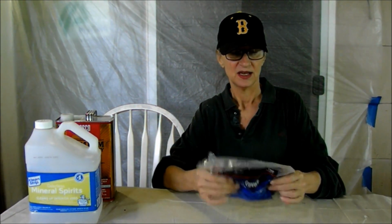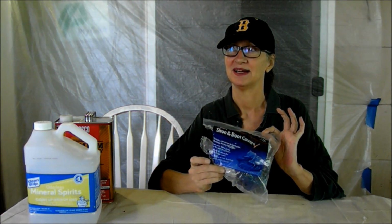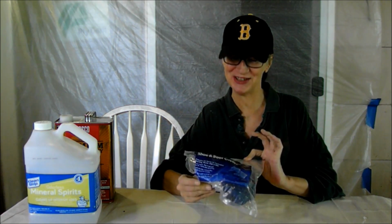Okay. The other thing I was using was these booties, and I learned the hard way that this is an important thing to do, because I accidentally stepped in some stripper with my sneaker and then tracked it, without realizing it, and then I was going barefoot and I burned my foot. So that's not good. Also, make sure that you have a pail of water next to you in case you need to rinse something off, but especially if you get anything on your skin. Okay, these are toxic chemicals, and so I just want to make sure that you're safe. Use goggles, use a mask.